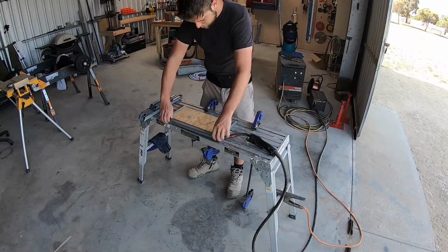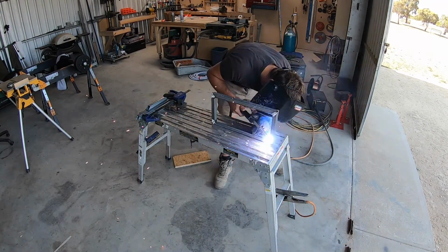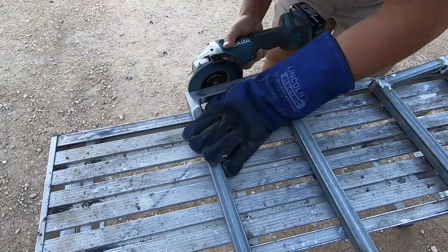I made swing-away number plate holders because I might want to use underneath the trailers for storage later. I mitered the corners of square tube and then used a piece of board to keep it square while I tacked it in place. I tacked in some sheet metal at the back, then welded on some barrel bolts and then welded to the trailer.